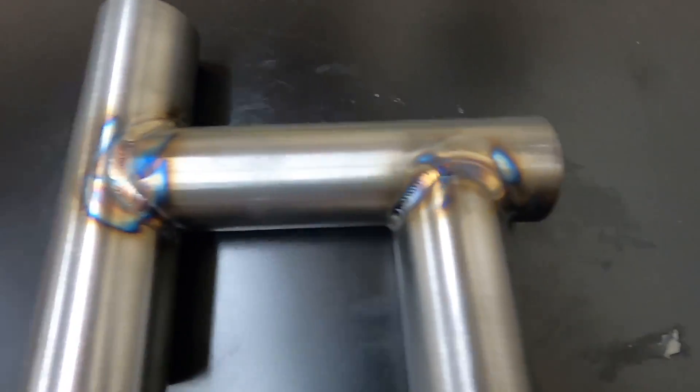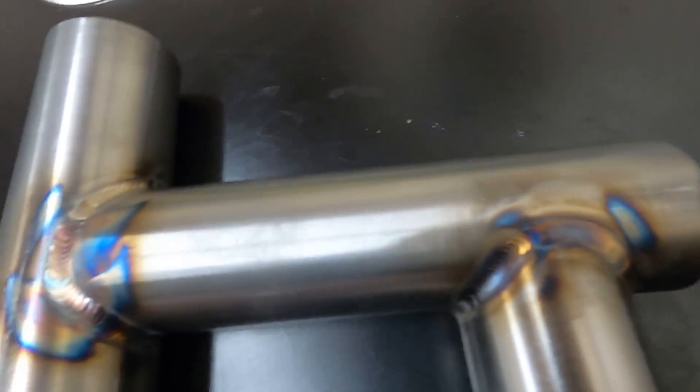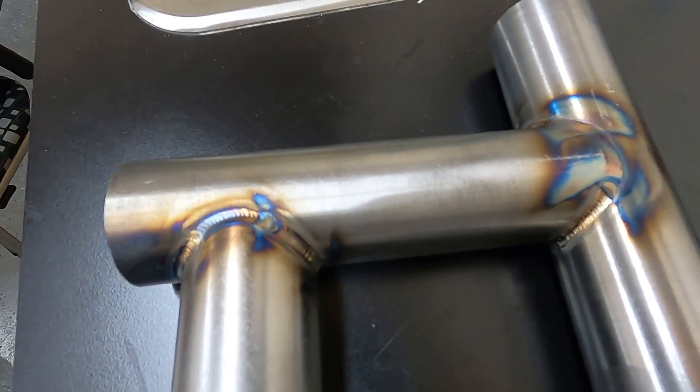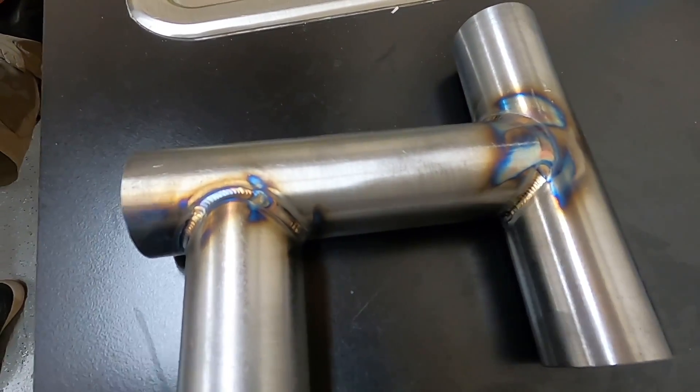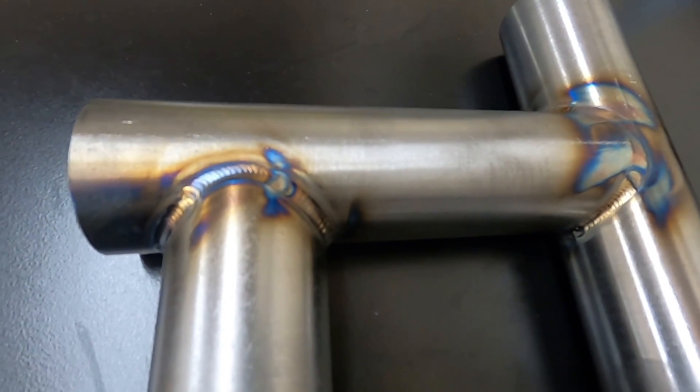All right guys, I brought the pieces in here because we didn't have very good lighting on the other side. I wanted to show you the differences between Corey's weld and my weld. I just run a little farther in between each dab — tighter dabs are fine as long as the weld size is adequate and there's not a bunch of undercut. You can see there's not a lot of heat lines — the heat affected zone isn't way out, it's not all burnt, and the gray color is pretty good. This side was with the 1/16th weld wire, and this side with the .045 — the weld is just a little smaller with .045 because you have to add a lot more rod. That's fine on smaller tubes: the 3/4, the half inch, some of the thinner wall tubing like .049 and .035. That's usually what we use — .045 or even .035 on small stuff like body mounts. Anyway, that's about it for this one. We'll do some more on this kind of stuff — hope you guys like it. Thanks for watching, make sure you like, comment, and subscribe.